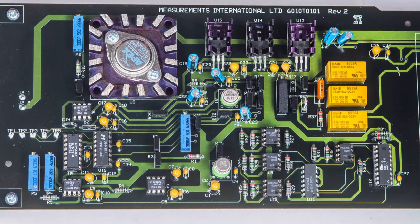There is a chip down there, this U1 in the metal can. That is a voltage reference for, I believe, 2.5 volts output. There are a few opamps, DG411 switch, 441 actually, and AD7543, also expensive chip. And on top you have just 5 volt and plus minus 15 volt regulators, just linear jobbies, nothing special. And there are three relays and a relay driver, so it's not that complicated board.